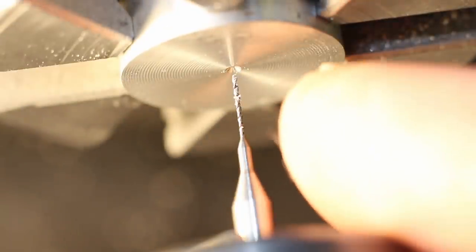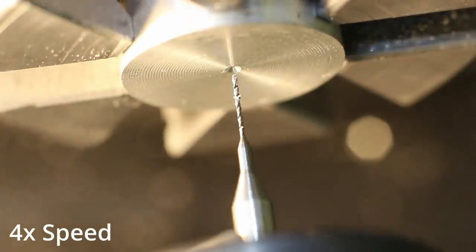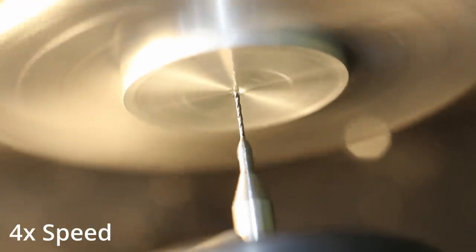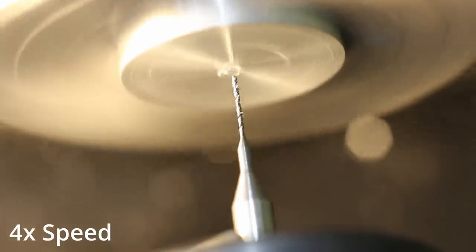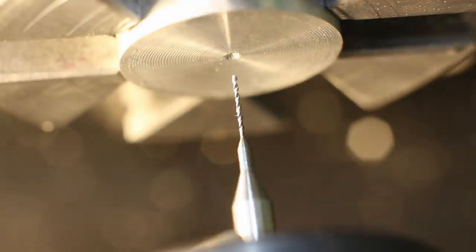This skill to see what's happening is really powerful and helps you in a lot of cases. And that's how you drill 0.4mm, 5mm deep with the carriage on a fairly large lathe. You don't need a bazillion RPM or some weird fine feed attachments or sensitive drilling attachments or a Kern Micro HD to do that. The Kern Micro HD comes into play when you go down by a factor of 10 in drill diameter.